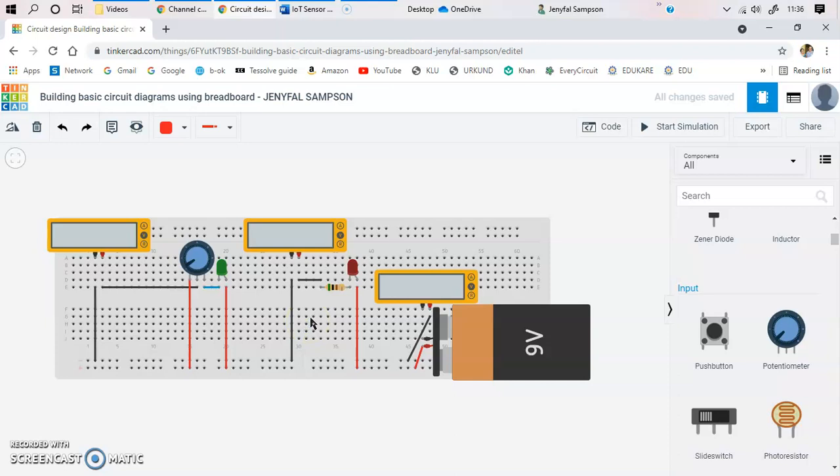The LED has one end connected to the left side and the other to the right side. The multimeters are placed to measure current in different regions of the circuit. Remember: when measuring voltage, keep the voltmeter across the component. When measuring current, place the ammeter through the circuit — you must break the circuit and insert the meter. The voltmeter is placed across, and the ammeter is placed through by breaking the circuit.